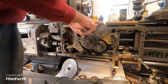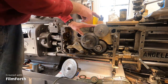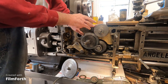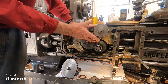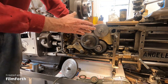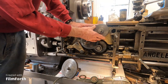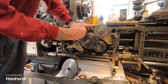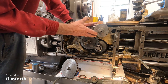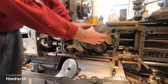What happened here - maybe at the same time they replaced the pinion for the rack, they replaced this gear too. This is a newer gear and it's not really compatible without some modifications and spacers with the original piece. What it did was it bottomed out the return spring, and instead of the clutch faces engaging, a coil-bound return spring worked the cross-feed for some time until it broke the bearing, because it's just not designed to work that way.